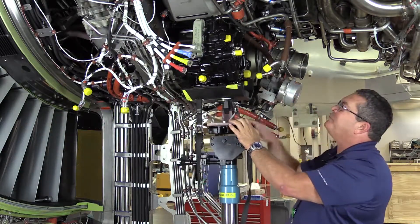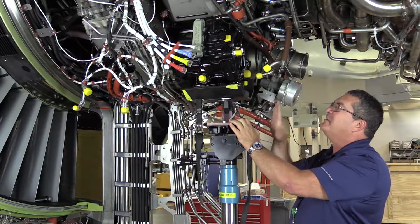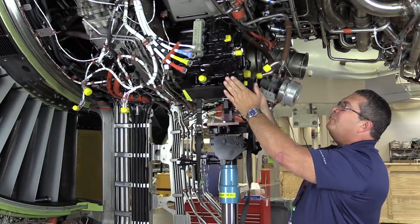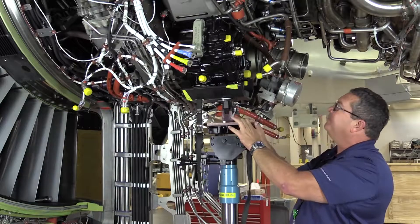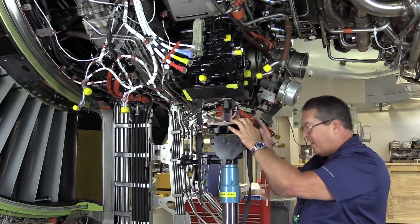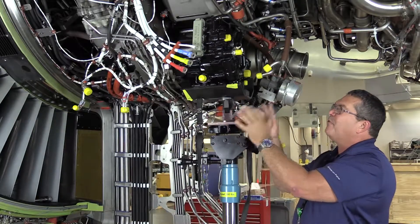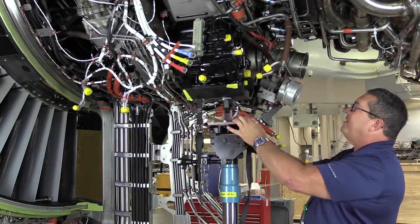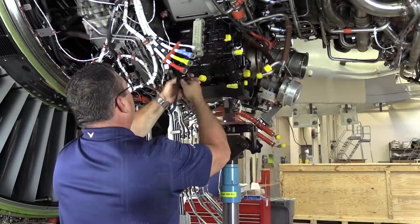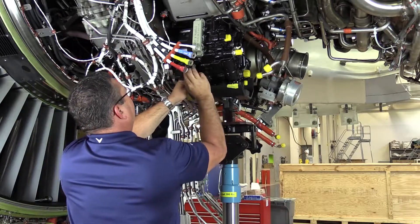I should point out that this training engine has no aft skirt on the accessory gearbox heat shield, and the starter air duct is removed as well, so the access to the IDG is a little better for me than it will be for you in the field. But the aft skirt does give you enough room to access the IDG and enough room to pull it aft away from the accessory gearbox before we lower it down. Now that my lift fixture is making good contact with the IDG — remember, the IDG is about 135 pounds — I want to try to take a little load off of the quad ring and support as much of the weight as I can. Now I can install the retaining strap and adjust it nice and snug so the IDG doesn't roll out of its lift fixture.